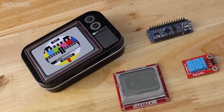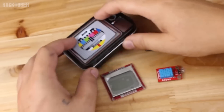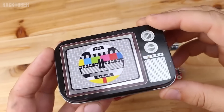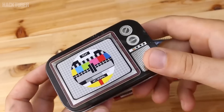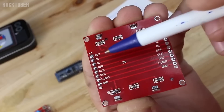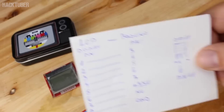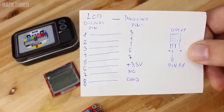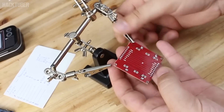To make this project you will need only 3 modules: the Arduino Nano board, the DHT11 sensor, and the Nokia LCD display. I also got a cute metal box to put everything inside. First we're gonna connect the LCD display with the Arduino board based on the wiring diagram. Seven wires are needed to be soldered between the LCD and Arduino board.